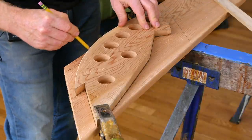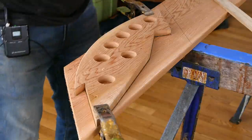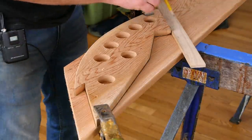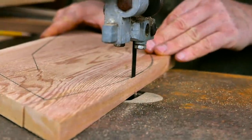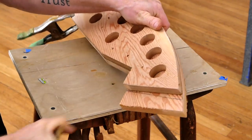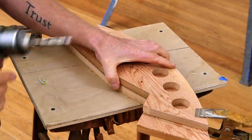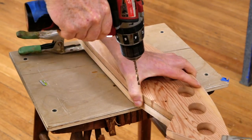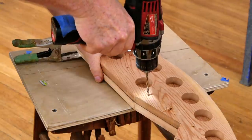I'm going to carefully trace this onto a new piece of wood and add an extra inch and a quarter up top just to make sure I have enough. Then I'll cut this out on the bandsaw and clamp them together. Theoretically, I should just be able to drill straight down the middle of my holes into the new stem, and everything's going to line up perfectly.